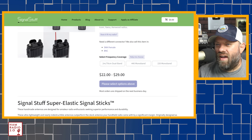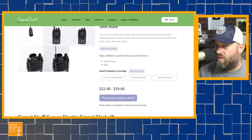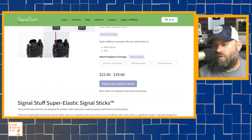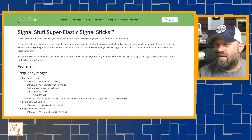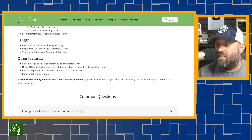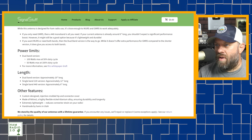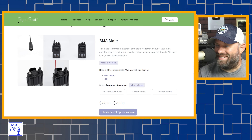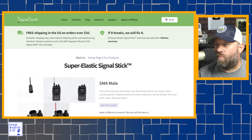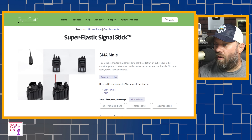So you can't really complain with that. Over here on the website, he has SMA female and BNC different style adapters, a dual-band 2-meter/70-centimeter, the 440 monoband, and the 220 monoband. I've been after Richard for a while to make a tri-band version — hopefully one of these days he'll do that. And when I talked to him this May, May of 2025, at Dayton Hamvention, he was looking at making a 900 MHz antenna for Meshtastic. I don't see that on the website yet, but I would not be surprised to find that very soon. Check out the link in the description below for Signal Stick as well.